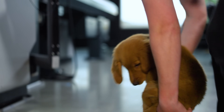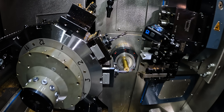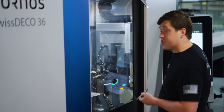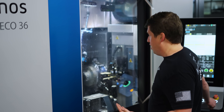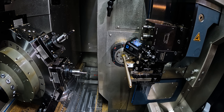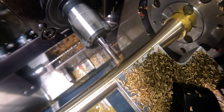Now let's press start on this CNC machine and purposely screw it up while it's running. I want to show you a really cool feature that will make your life a lot easier. One problem on a lot of Swiss machines is when you hit reset it starts the program at the top — and that's what I'm going to show you on this machine when you hit reset. It's going to come up, balance it with a steady rest, come in with the end mill. I'll let it start cutting and then I'm going to stop it. And now I'm just going to hit reset.